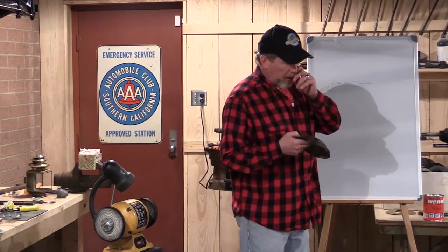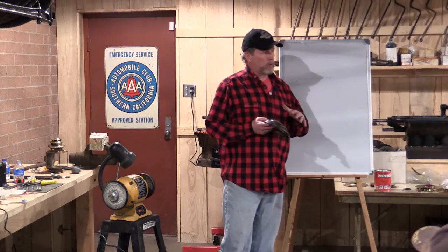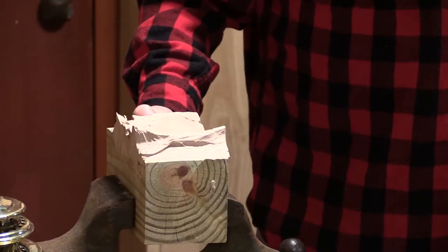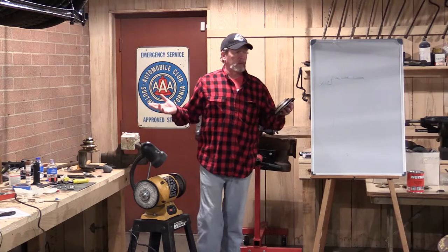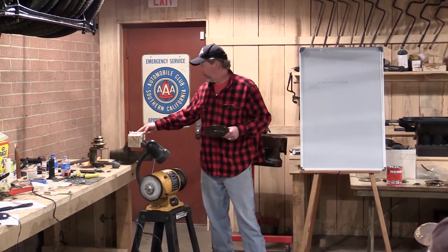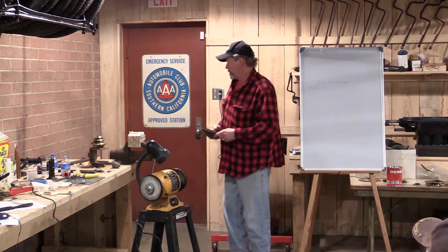Initially, you want to put on an eighth of an inch to a quarter inch coat just to get it to stick. The stuff tends to cavitate pretty badly. The thinner you can put it on there, the better you can control that. Once you get that eighth inch or so on there, you can start building it up and putting a backing with it. Here I used an exotic 4x4. This is probably a quarter quart of Bondo, I don't know, $12 or something. You can make a couple of these. Let's say you had a really badly damaged part and you're really going to be laying into it. These things definitely act as a dolly, but not indefinitely. So make yourself a couple of them, and they're throwaways. It's great. Thank you. Yes, sir.